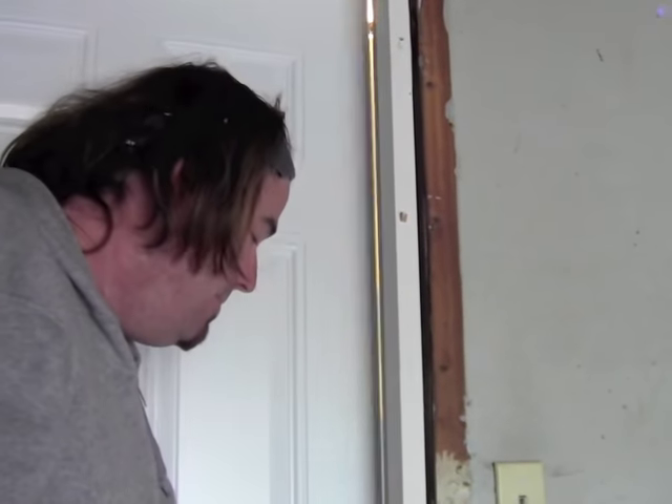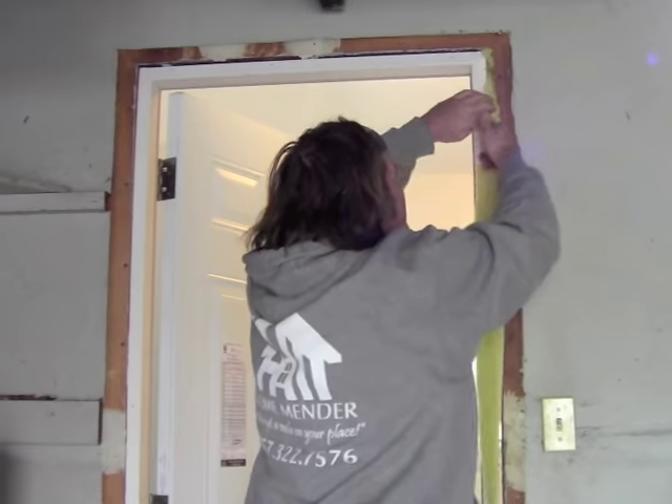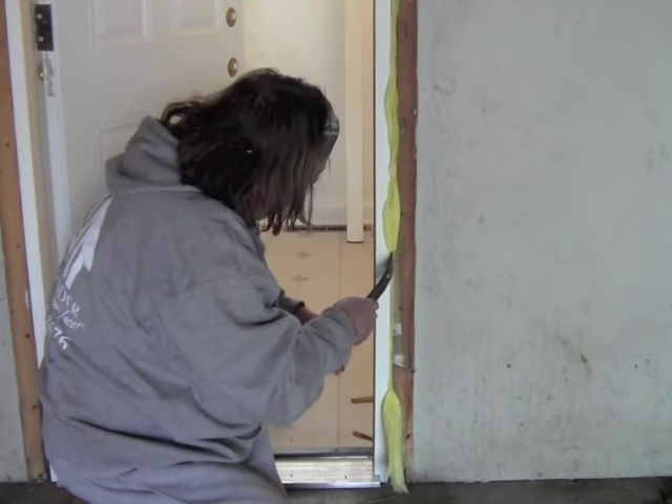Our door is secure. One final test — my door is contacting the weather stripping all the way down, and from the inside my quarter-inch line all the way is uniform, without a level. This door is going to shut and seal nice. Now let's get it insulated. I've got my roll insulation here — we're just going to fill the gaps in between the jamb and the framing. This side is really tight to the jamb and framing where I secured my jamb to the stud, so it's not going to need very much — just fill any holes that you see. Now we're ready to put on the casing. We're going to use our original casing, get the nails clipped off with some side cutters, and use the trusty air nailer, using the old paint line as a guide.